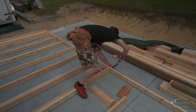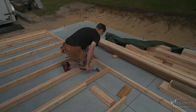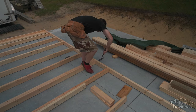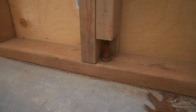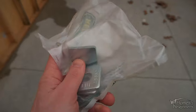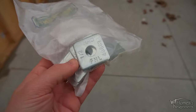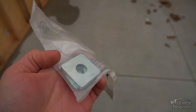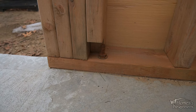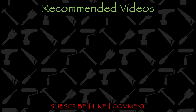I've already nailed down the sill plate so next is working with the first section of the top plate. The doubled up studs have four nails in total, two in each board just like the rest of the studs. Here you can see that notch when the wall is in place. I'll be installing these plates when the garage is closed in, just so they're not exposed to the weather as much. If you found this video helpful please give it a like and drop a comment below, and don't forget to subscribe for more home DIY videos. Thank you for watching.